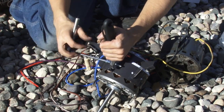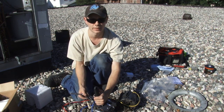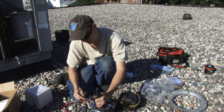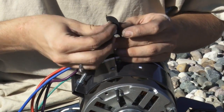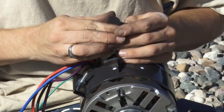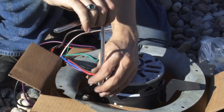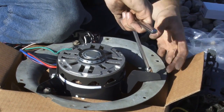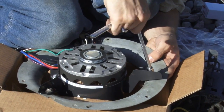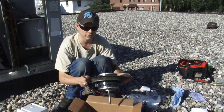When using a motor with a wraparound strap, make sure it is suitably tight so the motor does not slip in the mounting assembly. When mounting an item with rubber isolation washers, tighten them until the washer just begins to squish. You don't want them loose, but you don't want to compress the rubber all the way because it needs to be able to absorb vibration still — so you need a balance between tight and not too tight.